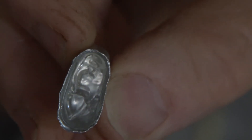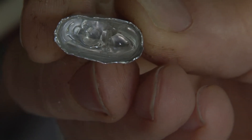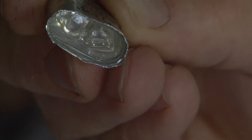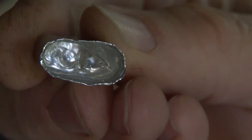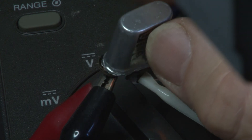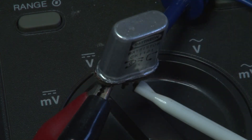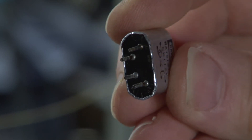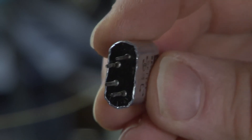The components sit in little pockets within a gel material, and I haven't disturbed it too much so I might be able to get them to sit in their original positions. There we have the light bulb soldered back onto the base, running with five volts applied — we're getting around 250 ohms, which is within the specification. We can actually get the original cap to fit on now, and it makes a small difference to the resistance, probably because the light is reflecting. So here we have the resistor reassembled, and I think we can now put that into the monitor and see how we get on.